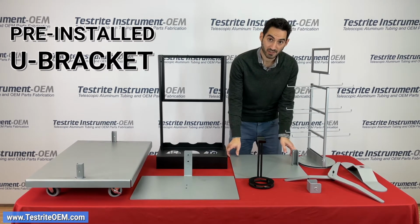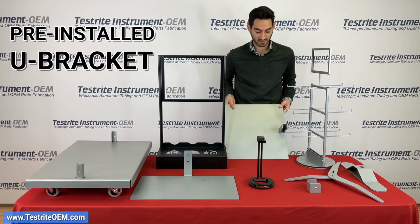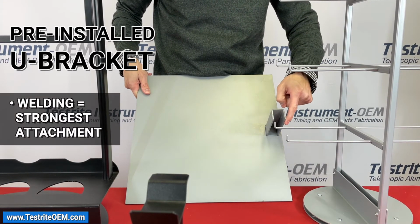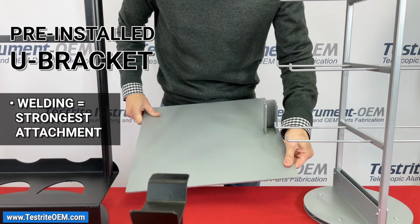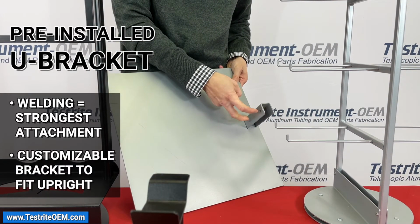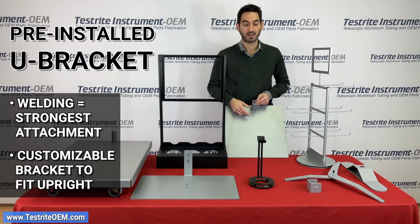So oftentimes customers are attaching an upright to their base. Now sometimes it's round and you can use the bushing that we showed you. In other cases, a screw from the bottom will do. But when you want something that's really strong, if we weld something to the bottom of your base and then you attach to it, it's going to be very strong, very sturdy. So this particular example, you can see there's a U-bracket made to fit the particular size of the upright, and then there are 2 threaded holes built right into the U-bracket for attaching. This is the strongest form of attachment we have.